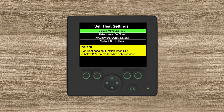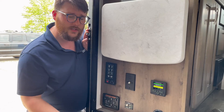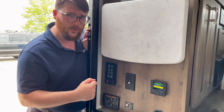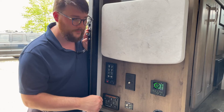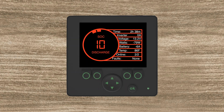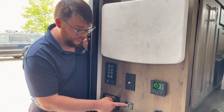The final button is for your heating elements. Our batteries do have heaters in them. The way lithium works is: at 32 degrees Fahrenheit you stop taking a charge in, and at negative four degrees Fahrenheit you stop being able to pull out power. With our heating function, you can modulate and make sure you can use your battery. Note that the heating function does not work if you're under 25 percent remaining state of charge.